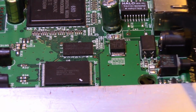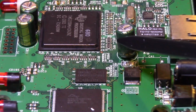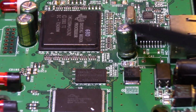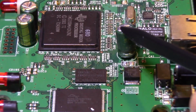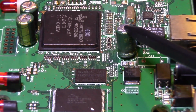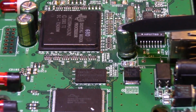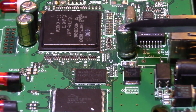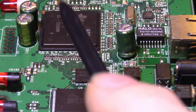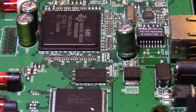There's plastic inside this connector shield. There's a relay with plastic on the outside, and an aluminum electrolytic can capacitor, which just by its nature can be damaged by heat. I'm not talking about the outside, I'm talking about electrically damaging it. The two most damaging things you can do to an electrolytic capacitor are overvolt it past its voltage rating, and heat it up. That shortens the life. It's almost an exponential curve where, once you reach a certain point in temperature, the lifespan of an electrolytic capacitor just plummets. So you want to protect that.